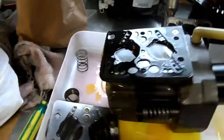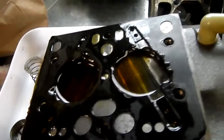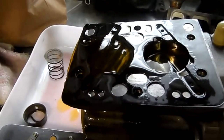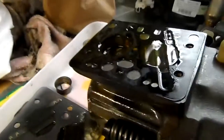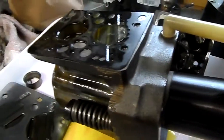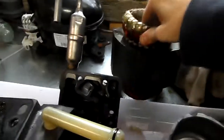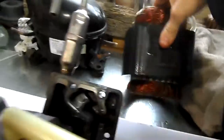I got a little bit carried away with the disassembly, but I think I found what killed this one. These cylinders both have oil in them — that's exactly how it was when I took the head off. So I'm sort of lucky it didn't actually try and break something, because that would have probably caused hydrostatic or hydraulic lock, which definitely would have snapped the rods. So I have a feeling that probably would have seized it up and just put a dead short in the stator core. The other side looks all right, but it's probably got a bad spot in it.